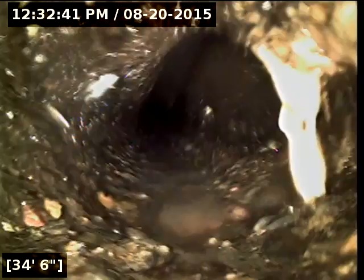I'm going to get the water turned off and let it drain out. It feels like I'm hitting a blockage here. Looks like we have a big root intrusion. That water is now drained out. You can see here there's a root intrusion that's blocking pretty much the entire sewer line, and it's pinched down far enough that my camera is having a really tough time making it through there.